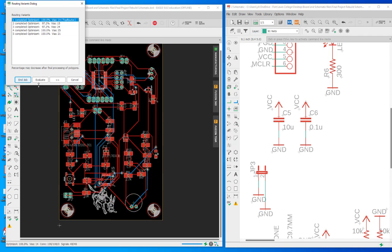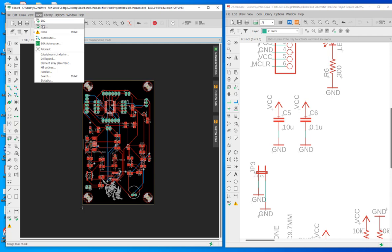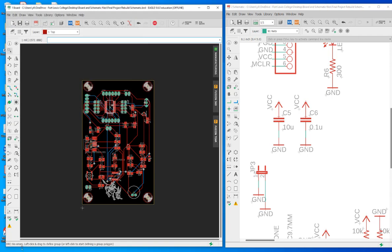Okay, that's a very easy routing. So you can see that if you do the manual layout here, it will probably be successful at the first time for the routing. It's 100%. Then end the job, and I think this is done. I can do a DRC check, just pay attention, see if it's matching the schematic, and see no errors here at the bottom.